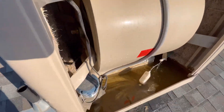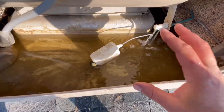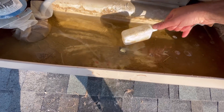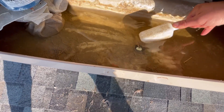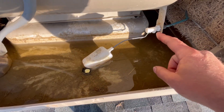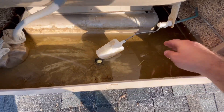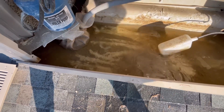If you live out east you've probably never even seen one of these. Now this one, we still have to locate where the water line is. If you want to button everything up before you figure out where the water line is, all you have to do is bend this down to where it's pressing on the bottom of the swamp cooler, and that'll keep this from letting more water in. We still have to locate where the water shutoff is for this particular unit.